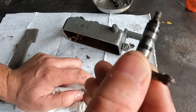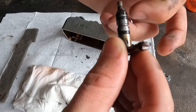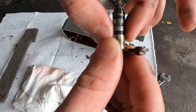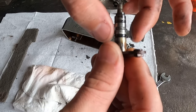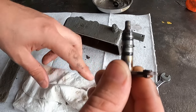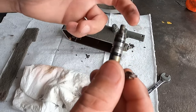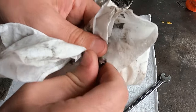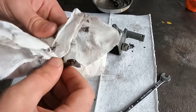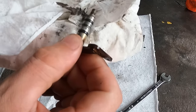This is where my problem is coming from — these two O-rings here. There are three grooves: there's an O-ring here, no O-ring in the middle, and then an O-ring. If you run your hands across them it's perfectly flat — there's no bump out for the O-ring. That means these O-rings are just worn out. I'm hoping that swapping these two O-rings should solve my fuel leak problem. I'm going to get everything cleaned up, find the corresponding correct O-ring in the bag, and get her back together.